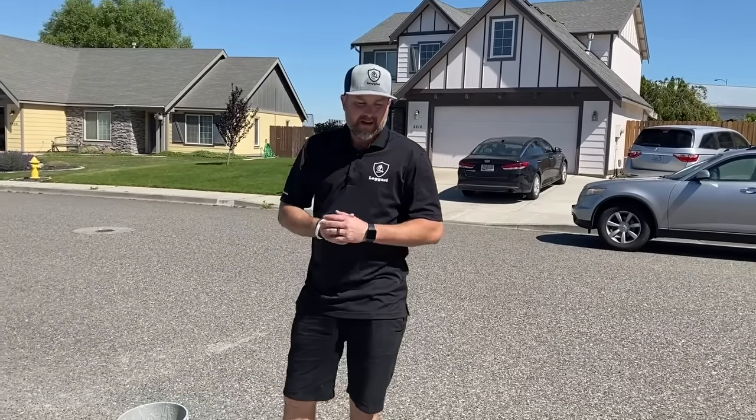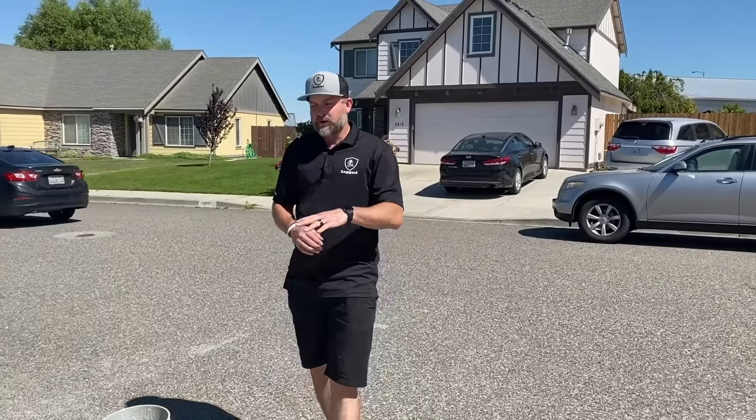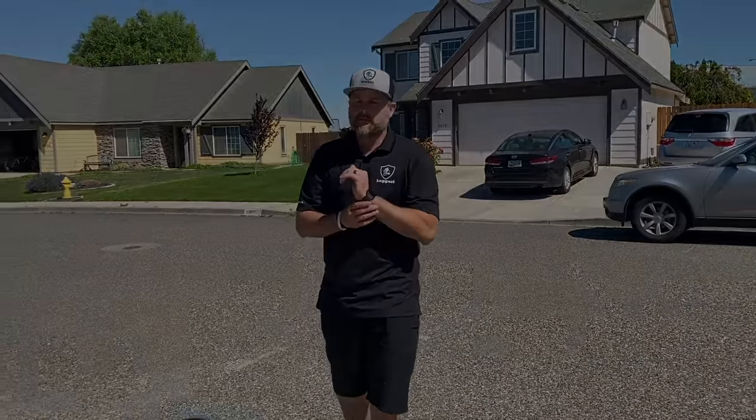And then you want to make sure, if you're going to do that final coat, that you're able to apply the sealer, the top coat, the same day. Because what'll happen is people walk on it, they leave footprints, right? It's not a sealed surface, so it's porous. It's prone to staining before that sealer gets on it. So we'll let this set up, and then we'll show you how to do the sealer.